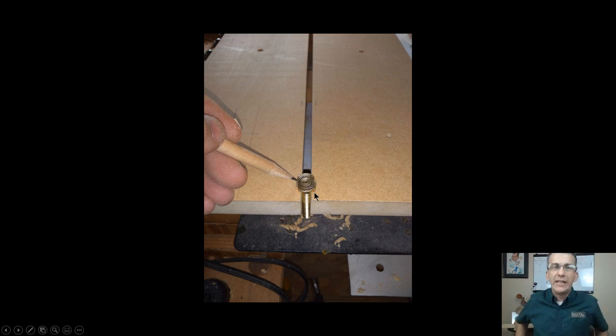If you're getting a toilet flange hardware bolt from Lowe's or Home Depot, those bolts have an oval shape to them. A standard T-bolt for T-track has flat edges. So sometimes if you get your T-bolts or toilet flange bolts from Lowe's, you end up having to grind the sides so they fit into the T-slots on your table. Amazon sells regular T-bolts, and these are quarter 20 T-bolts designed for my size T-tracks, because T-tracks vary as well.